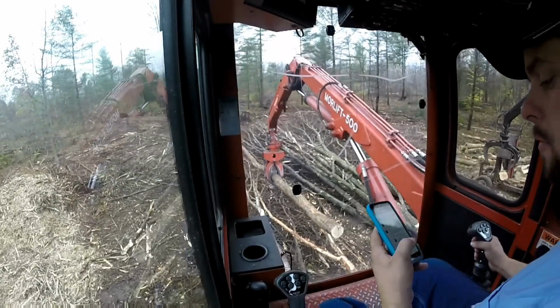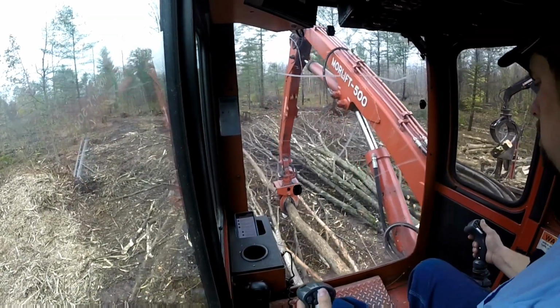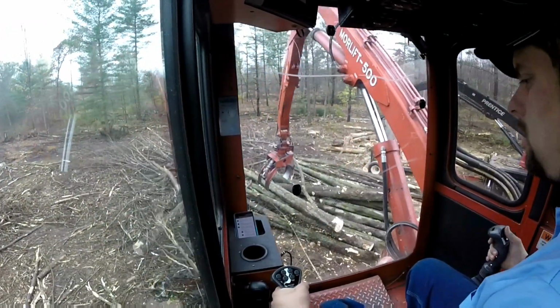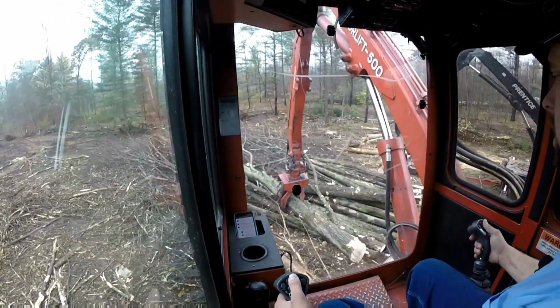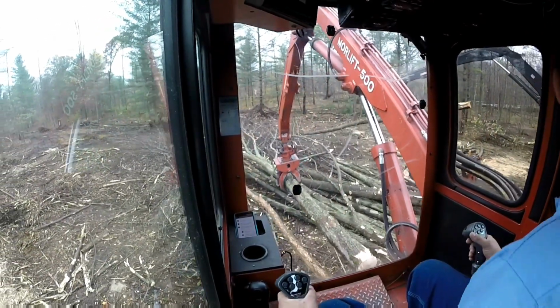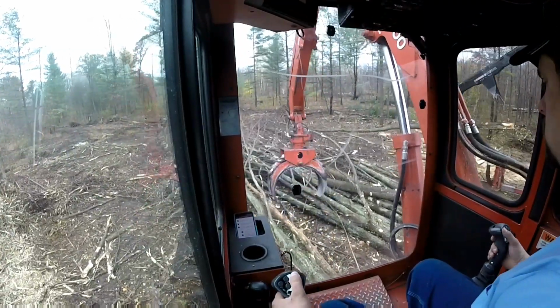How do you prepare your equipment for the very cold startups? Winter's coming. Basically, you make sure your fuel filters are clean, and by clean, I mean you're changing them out regularly. You don't want to leave them in there too long. You don't want them things gelling up in the winter. It's no fun when you get out here in the middle of winter and your fuel filters are clogged up and these motors won't start. So that's what we kind of do. Make sure you got some diesel 911 on hand.